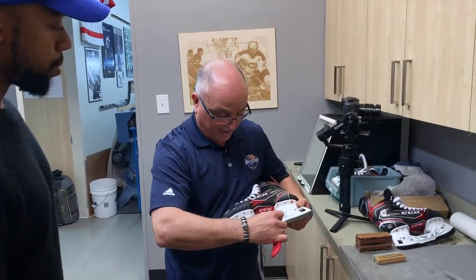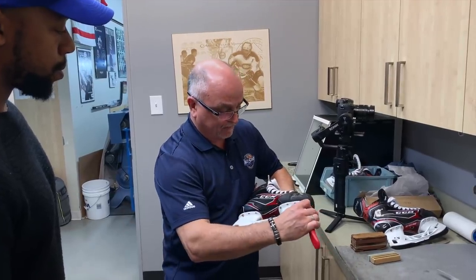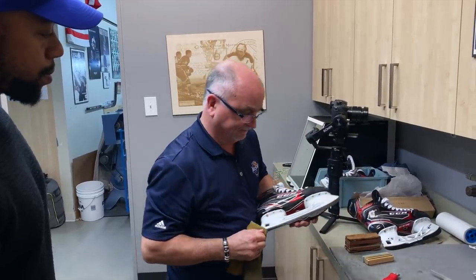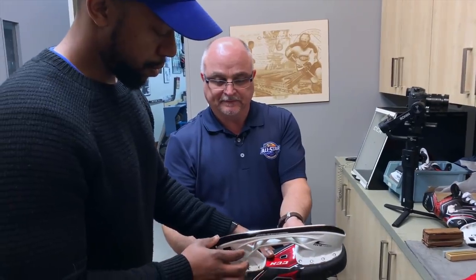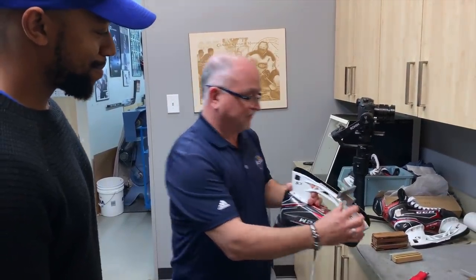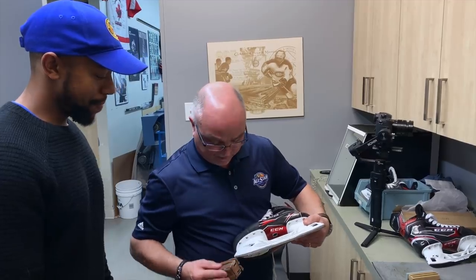Because it's a black blade, I don't use an aggressive stone — this is a ceramic. I pass very lightly on the outer edge so as not to remove the black edging. I like to use my fingers just to feel it. Pass your fingers on that. Now the true test — we check if we're square; if not, we go back to the machine.